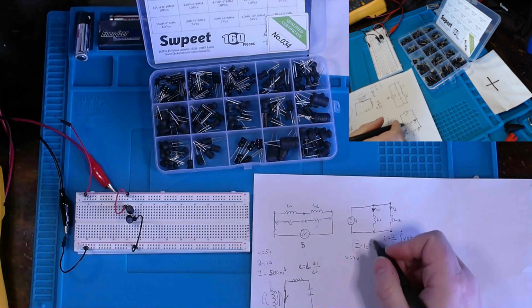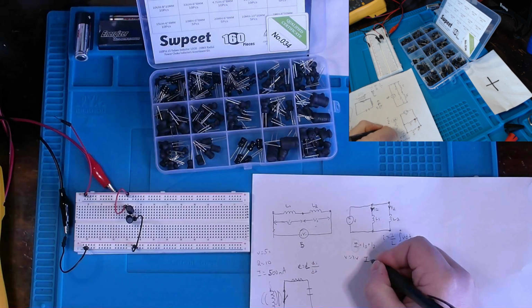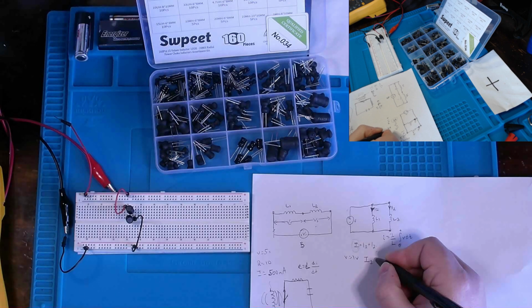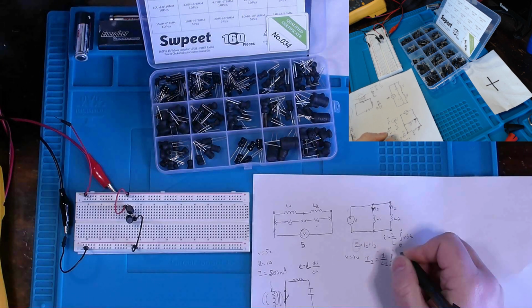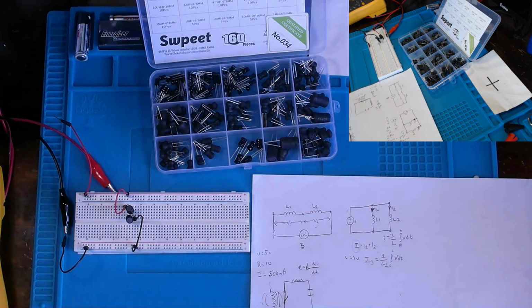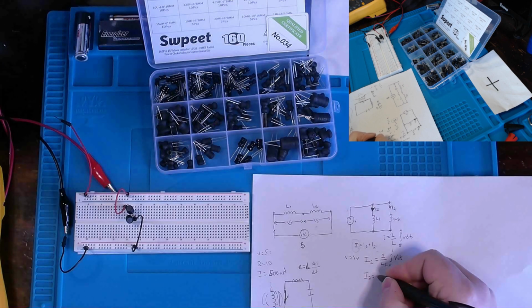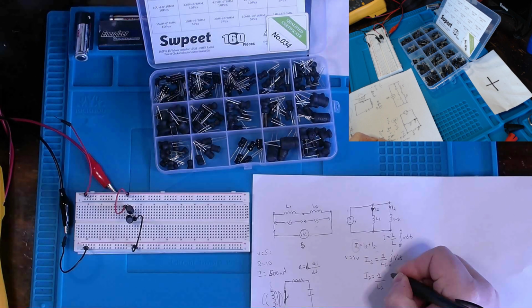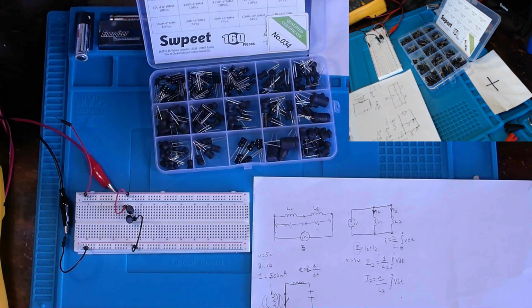We could say that I1, our first measurement in which we're trying to determine current, equals 1 over inductor 1, integral of voltage times the difference in time, dt. And then we would say the same, I2 equals 1 over L2, integral of V dt, just like that. Okay? And then from these equations, we can develop other things.